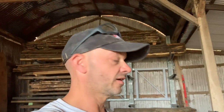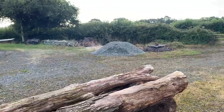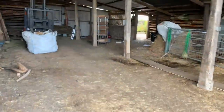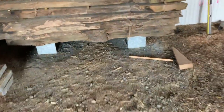We're going to be working on these levels today. We had some horrendous weather last week so the digger — a friend of mine owns the digger and the dumper — got stuck in the mud. It's now out and he's finished with it, so he's bringing it today. Today I'm going to be digging up all this and putting some type one down here. You can see where the mud starts to come through. I've got six tonnes there — hopefully it's enough. I'm going to get this lot level so that when we're going with a forklift, we don't get stuck on this soft stuff, and we can hit it with the forks level moving stuff in and out.